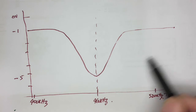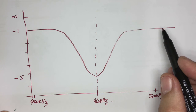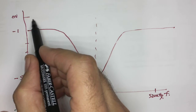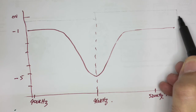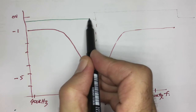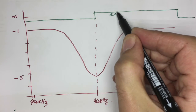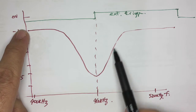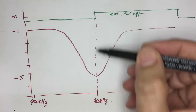A few things are important to see this on the equipment I've got. The signal generator can produce this sweep, no problem. It also produces a sync signal — a step signal — when sweeping. I can use that sync signal from the back of the generator as the external trigger of the oscilloscope, so I can get the waveform to stand still on screen. The reason I want it to stand still is so I know what frequency is showing up where, which relates to the grid of the oscilloscope and the timing I use.